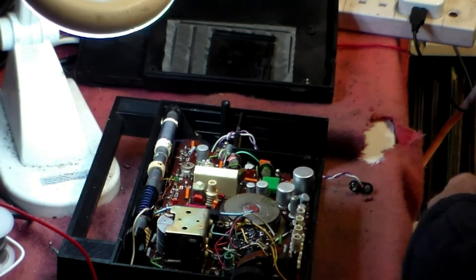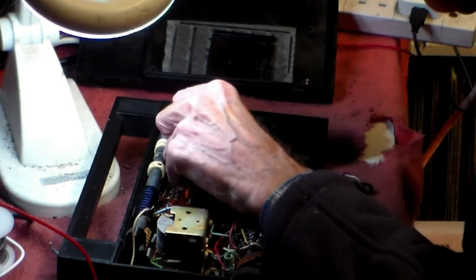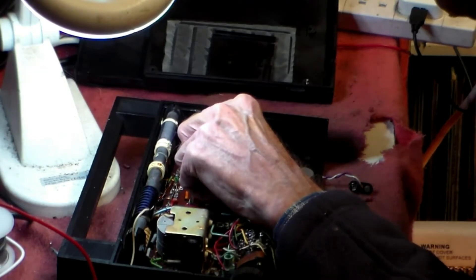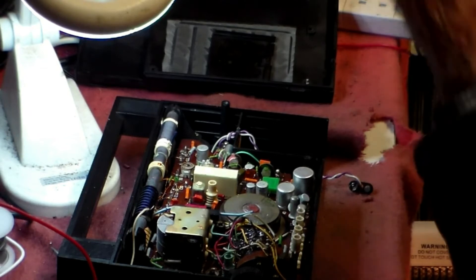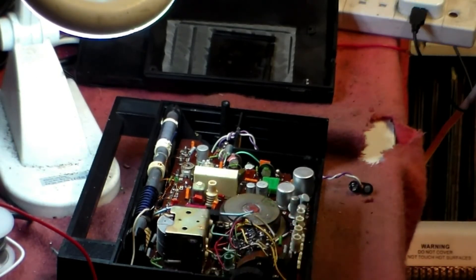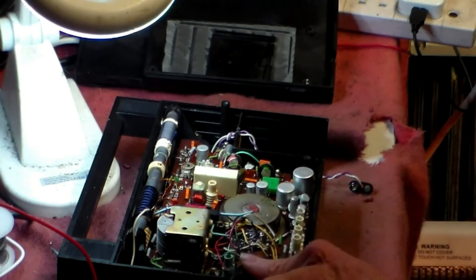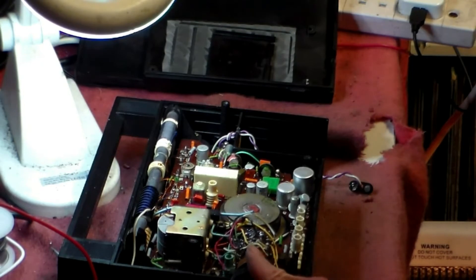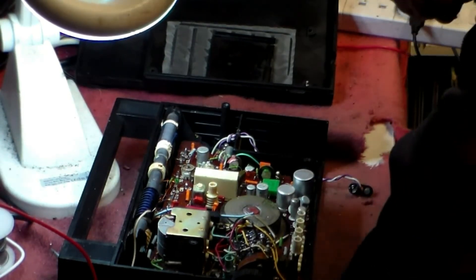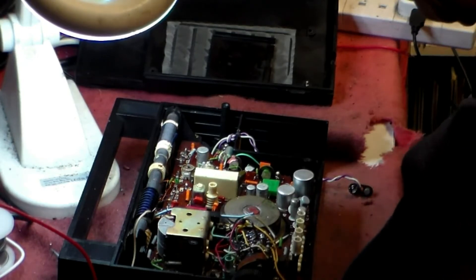I've got the circuit diagram on my thumb drive. I've looked at it and found out where the wire goes off the antenna coil — it's where it's meant to go and it's connected, so that's good. But it doesn't actually work terribly well. I've got a very, very quiet 5 Live. Loosening the board, it stopped. Tapping around, it's either the waveband switch or the tuning cap, which I believe is shorted. It crackles like hell when you're turning, which suggests the tuning cap is the source of the problem.